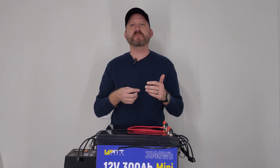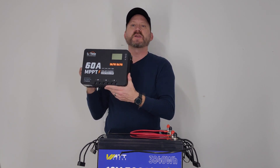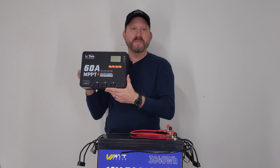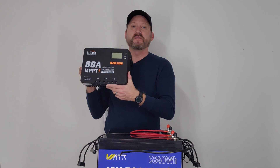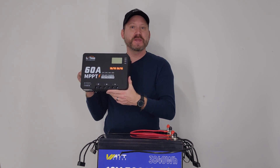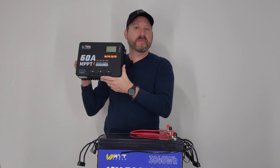The difference is with the charging and the discharging. When charging by solar, your charge controller is going to have a different maximum wattage input rating — the maximum number of solar panels you can put into the system. This 60 Amp charge controller will run a 12, 24, or 48-volt battery system. However, on a 12-volt battery system the maximum amount of solar you can put in is 900 watts. On a 24-volt system you can put 1,800 watts into it. So just by reconfiguring the battery, you can cram more solar power into the batteries with the same equipment.